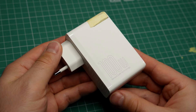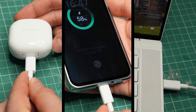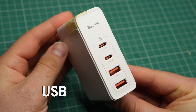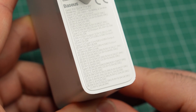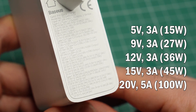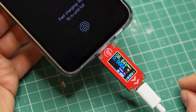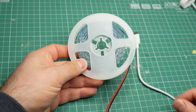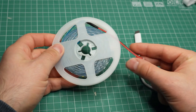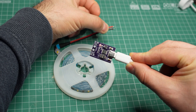This is a 100W power adapter and I use it to charge anything from my earphones to my phone and my laptop. That's possible thanks to its support for USB power delivery, meaning it can provide a wide range of output voltages between 5 and 20V. But there's a catch: only compatible devices can request anything above 5V from this adapter. So if I wanted to power something like this 12V LED light strip, I can't — unless I have one of these.